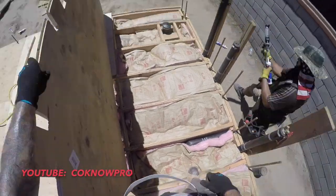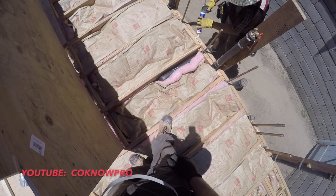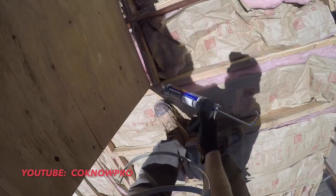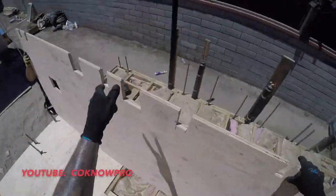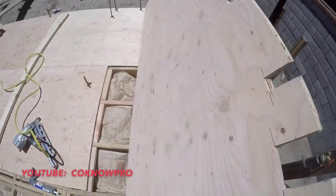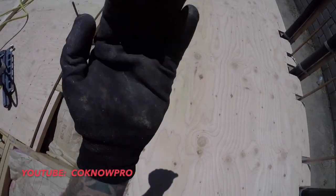And so basically we can keep it as perpendicular to the joists, and that gives it the best strength. It helps for layout too. That's basically when we do the framing layout, so your plywood can land 8 foot on center, or 4 foot on center on your backing. All right, everybody, that's what I wanted to point out. If you're watching the video and wondering why a couple sheets of plywood are facing the opposite direction, that's the reason. We want to maintain our plywood running perpendicular to our floor joists.